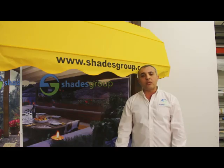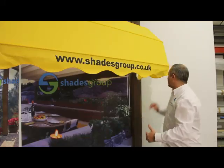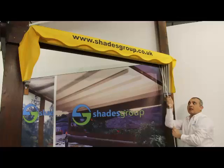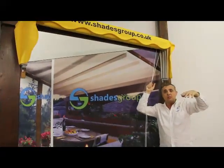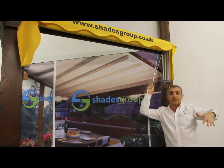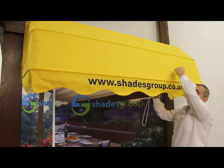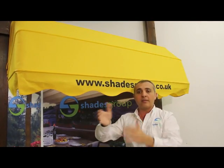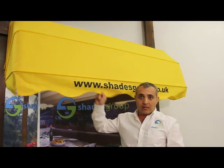One piece of advice to your client: always open the blinds on a heavy rainy day, because when you keep the blinds folded, as you can see here, you create a fold, and this fold will become full with water, and sometimes with a big canopy they collapse overnight. However, if they don't collapse, when you open them the next day, you will see a dirty mark here, because the water has stayed there for a night or a couple of nights. So highly recommended to keep it open, let the rain go over it, let it get dry, and then you close it back again.